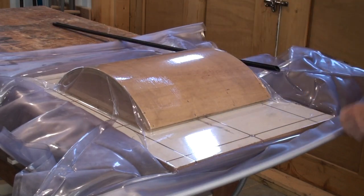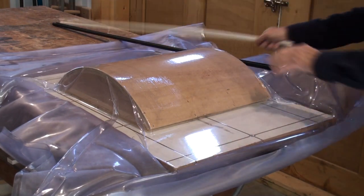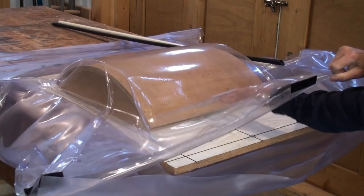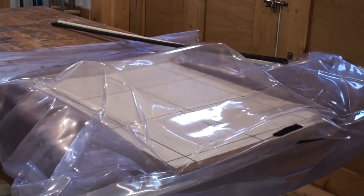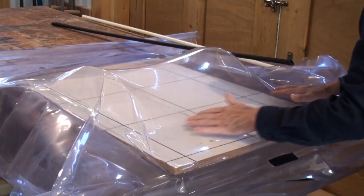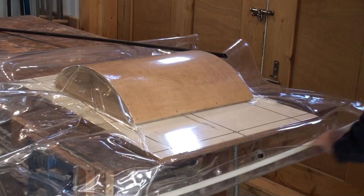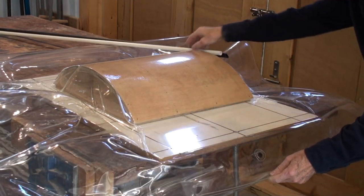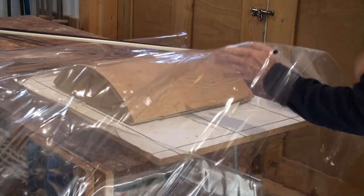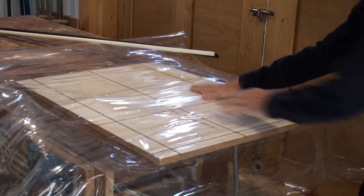Here is flexibility and memory retention in an actual bag pressing situation. I have a curved form in a vinyl bag under full vacuum. Undo the closure and remove the form — you can clearly see what was just being pressed. It will eventually move back to being flat, showing medium flexibility and memory retention. Now the same situation with polyurethane: undo the closure and remove the form — right back to being flat. No memory. Nice flexibility with excellent memory retention.